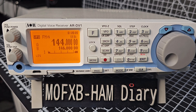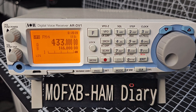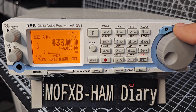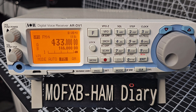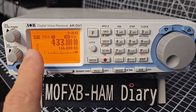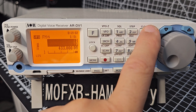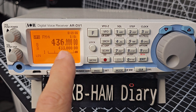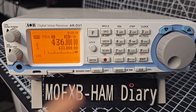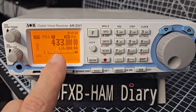What I like about this system is it's so easy to remember. So let's say we want to scan from 433.000 — enter frequency, then enter, then mode. We can select auto by holding mode, or just turn to FM. If you want to scan digital as well, it's probably better to use auto because then it will find anything digital. Then go to the B band — press VFO again, you'll see B is at the top now — and put in 436.000 on the B section, select the mode again, do auto, and enter. Now switch back to A, so you've got 433.000 to 436.000.